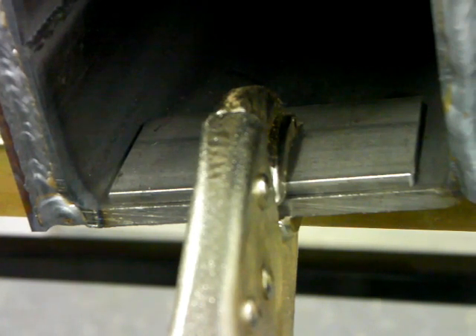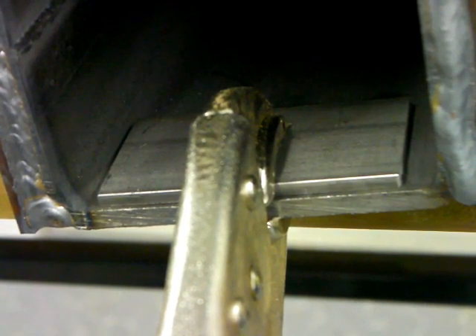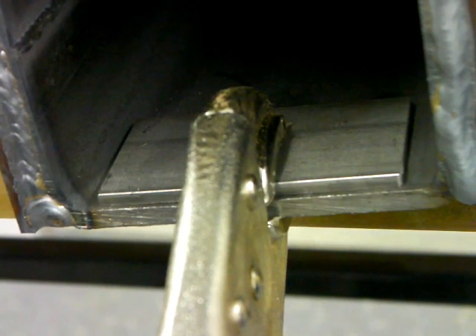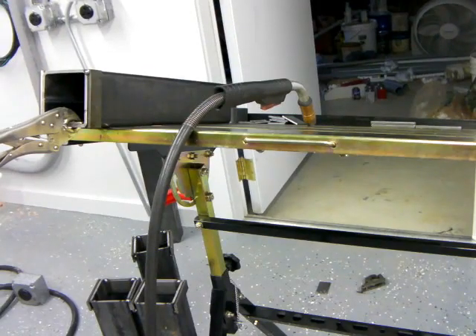The stiffener plates pose a little challenge because you have to get up inside there and there isn't much room — the welds have to be smooth and flat. The MIG nozzle is always in the way, which has always been a bit of a challenge. They're recessed back in there a little bit because these aren't chamfered, and I'll show you how I deal with that.